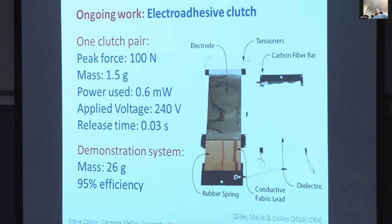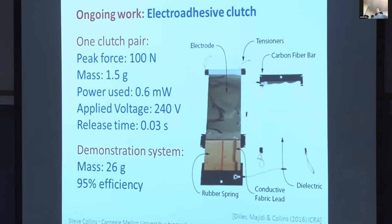So the functionality that I want and have wanted for a long time is this: big energy storing spring, CVT in series with your output. You can imagine if the spring is stretched a little bit, then you can get any force you want by changing the ratio of the CVT. And then you can port energy into and out of the spring with force control.